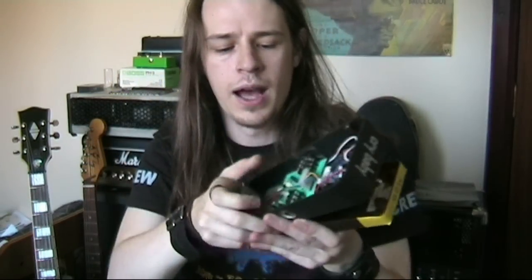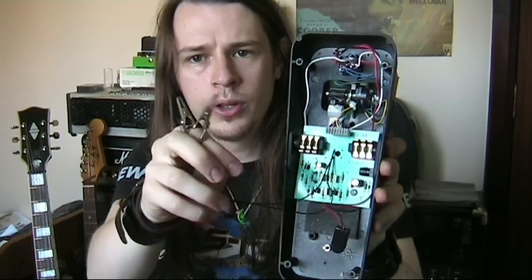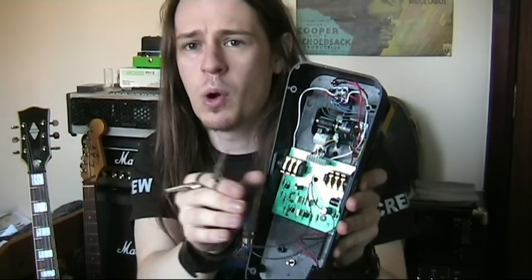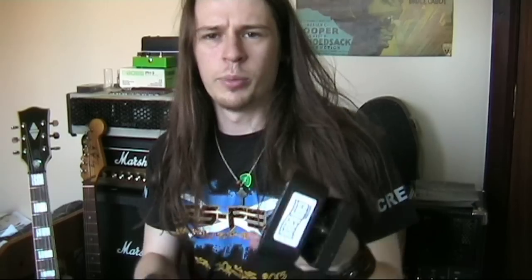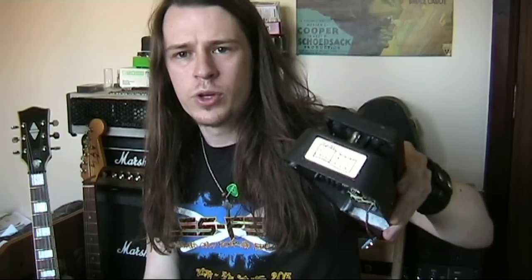For this test I'll be using my standard modern Crybaby, which I've modified before. What I've done is I've removed the inductor and wired on two crocodile clips on the ends of a length of wire, and I'll be able to attach each new inductor to these and swap them in and out nice and easily, and we'll hear the differences between them. And I'll be using this older Crybaby with the toroidal inductor for some reference sounds — so this is what you'll be hearing as my stock good wah pedal, and we'll be able to see how the inductors sound compared to this.